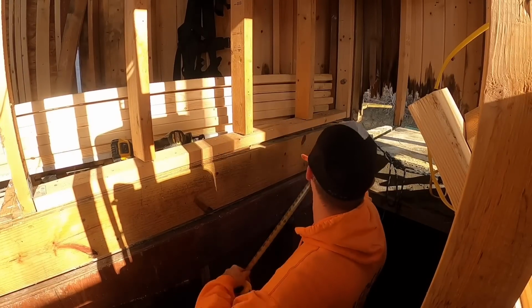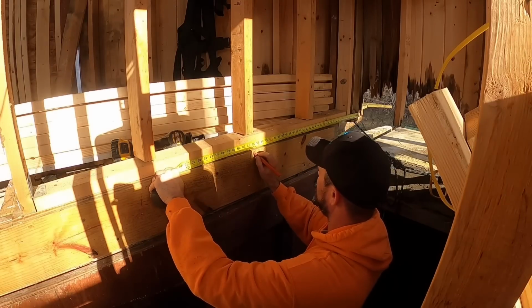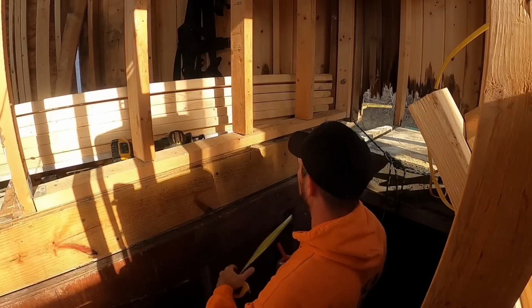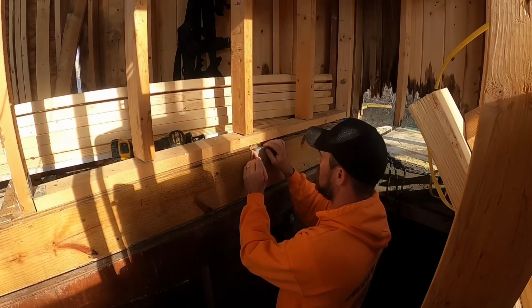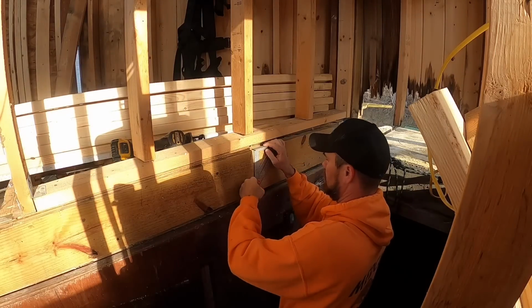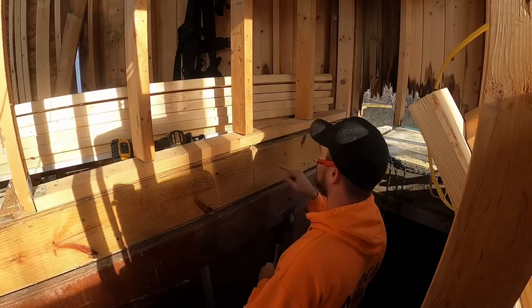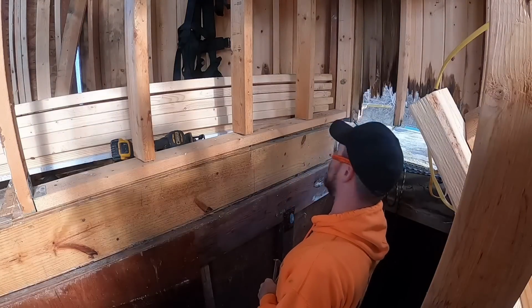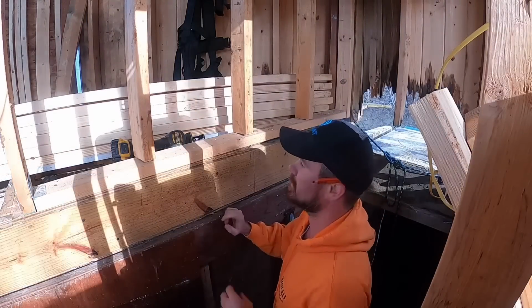So what I'm gonna do is I'm gonna pull the dimension. Looks like 3 feet back from where the bottom plate will be. I'm gonna trim this inside joist off completely. And there's a double joist here. So if I get this one off of here, we can run the new one in line with the outside and splice across this. So let's get this cut.